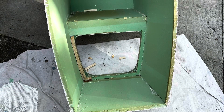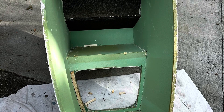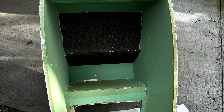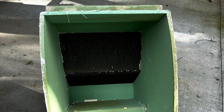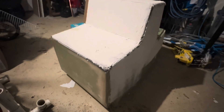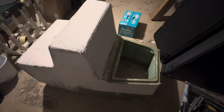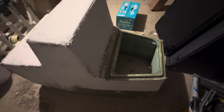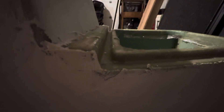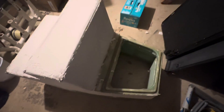Here's a shot of the inside — I pulled it off of the jig and it separated pretty nicely. Some areas did stick a little bit, but it wasn't too bad. It came off really nice, clean, and straight. You can see that Coosa area and a toe rail. Here I started my fairing — I'm using Q-cells and polyester resin. You can see this front gutter area on that front seat; it's got a little lip, so it's a gutter all the way around the front seat, which I think is pretty nice.